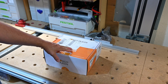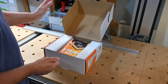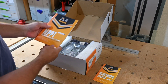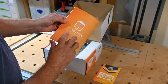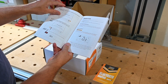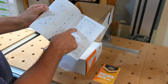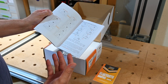I'll be honest, I didn't even know that Power Queen had these charge controllers to go along with all of their LiFePO4 batteries, so I think it's going to be a pretty cool little test. In the box you're going to get a Bluetooth-capable MPPT, so you've got your Bluetooth instructions and your actual MPPT instructions. Power Queen does a really good job of making sure the manuals are in correct English, with lots of pictures on how to properly set up the wiring, and a whole lot of charging parameters for LiFePO4 — over discharge, equalizing voltage, boost voltage, and a lot of stuff you'll need to properly charge your battery.